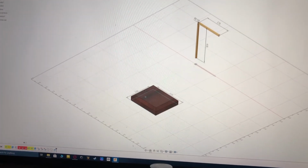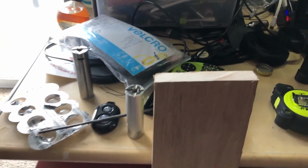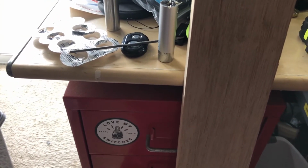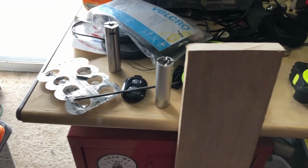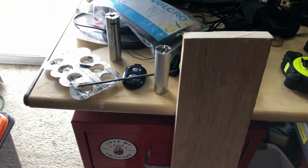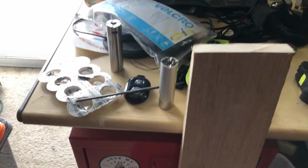and I got some wood. I actually have some mahogany. It's the same mahogany that I made Trevor's pedal board out of. So we're just gonna take these pieces of wood and measure them up, slice them up, drill a hole, and then we'll get my router out. I got a nice Bosch plunge router. And then, once we cut these to size, we'll chamfer the edges around, and then we'll bend up the brass rod, and we'll stain all this, then we'll put it all together.